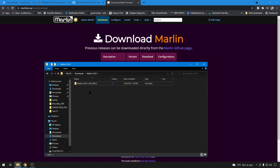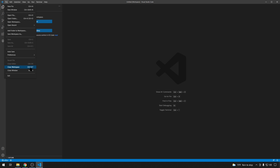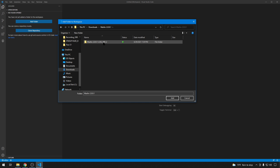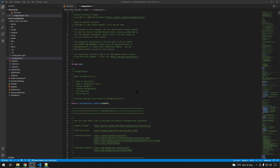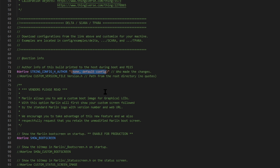If you need to know how to set up VS Code, I did do a video on this recently — I'll leave a link in the description. Open up VS Code, go ahead and add a folder — if you have problems with folders, go to File and close your workspace, then add a folder. Head to Downloads, Marlin 2.0.9.1, and add the folder that contains the Marlin folder. Expand Marlin and then we'll start in Configuration.h. We're going to change the description — it's for SKR-2 and the Log printer.